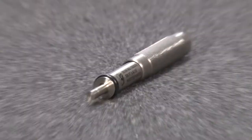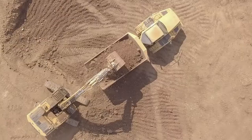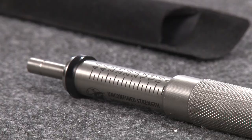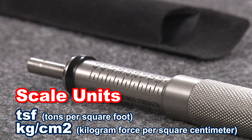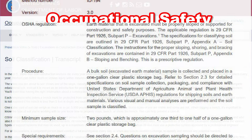The HM-500 estimates the unconfined compressive strength of cohesive soils. Scale units are shown in tons per square foot or kilogram-force per square centimeter. Also known as the hand penetrometer, OSHA lists this handheld lightweight device as required equipment for manual testing of unconfined compressive strength of cohesive soils.